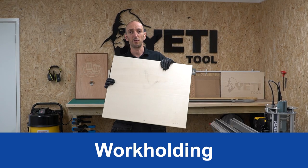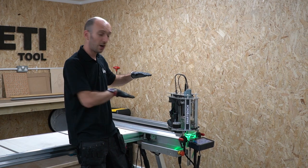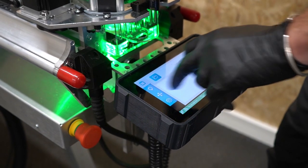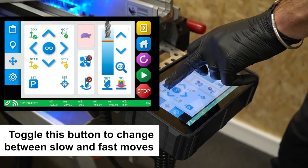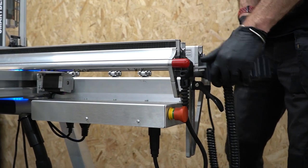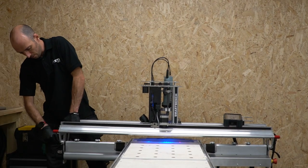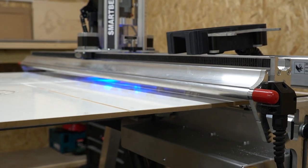It's time to get our stock material fixed to the bench. To position the materials I need to lift the upper beam so I can slide them underneath, and to do that I want to have the Z head in the middle of the upper beam. I'll go into the pro app, onto the manual move screen, and navigate the Z head over to the middle of the beam. Now the Z head's in the middle, I'll take the console out, unlock the beam, lift it up a little, and slide my materials underneath. I can now load on my spoil board, sliding it underneath the beam.